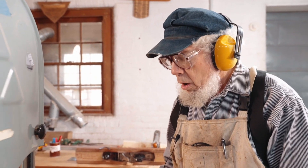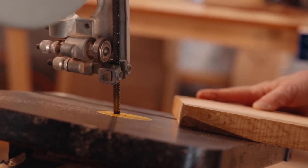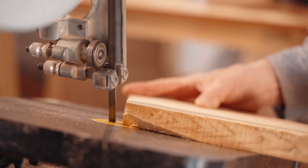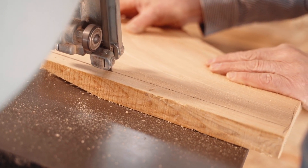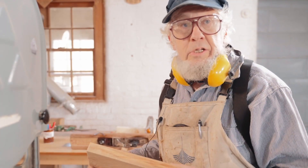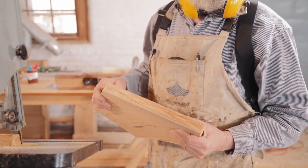So we're ready to cut. Have your safety eye glasses on, and your earphones on — you're now going to make the cut. Leave the line so you can see it. Nice clean cut. Make sure your bandsaw blades are sharp. You don't want to be working with a dull bandsaw where it's smoking all the time. If it's doing that and it's making black marks, it's not sharp. So now we're ready to take this to the bench and smooth it out so it's nice, flat and square.